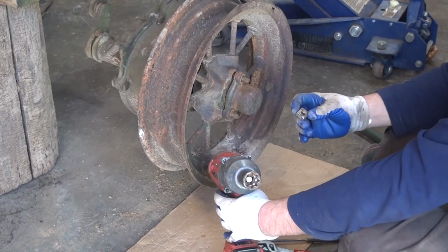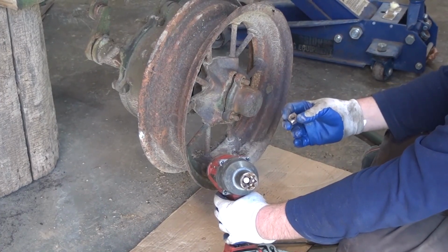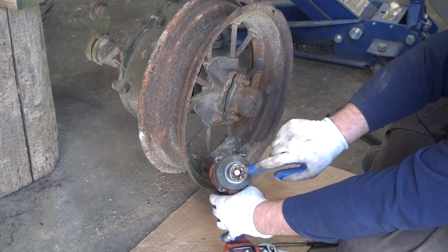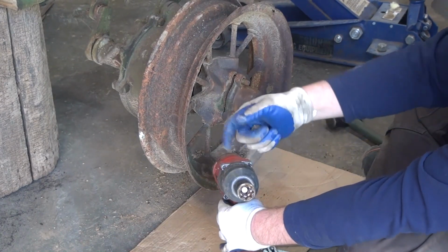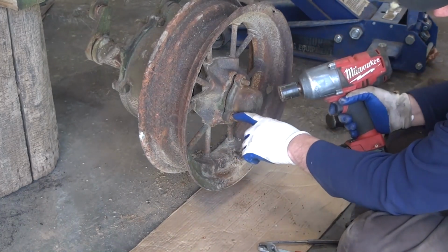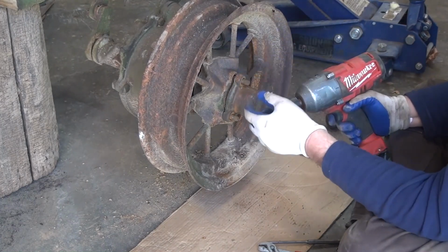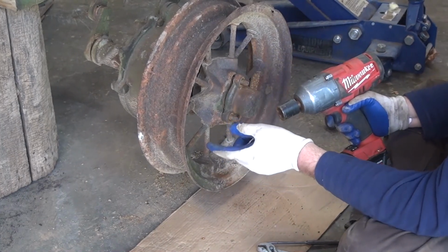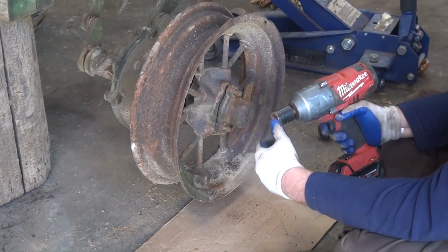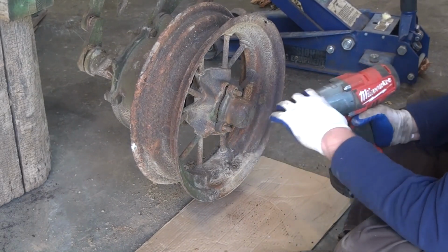Square hardware can sometimes be a challenge. Although it tends not to rust solid and twist off bolts, it can still be rusty. 8-point sockets are really nice if you do much work on a plow. These caps always take a 13/16. Most of your large bolts on the frame take a 15/16, and the large nuts for those 5/8 bolts are 1 inch. If you wanted to order square 8-point sockets, you can find them on Amazon and eBay.